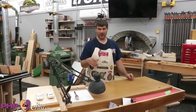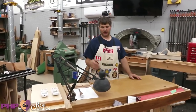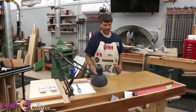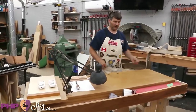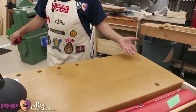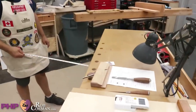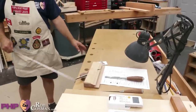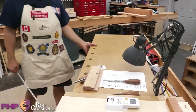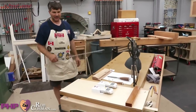So if you take that sheet, now they always give you an extra inch in both directions. So a 4x8 sheet is going to end up being 97 inches long by 49 inches wide. And you rip two 20-inch strips. We have a video that walks you all the way through this. But you take on those 97-inch strips, you cut off a 60-inch piece. So you have two premium 60-inch pieces, and you've got two pieces left over. So the full-size piece on top, a full-size piece on bottom, and the two pieces that make up the middle section are joined in the middle. Glue the whole thing together, and it's as if it's all now one piece. So you've got 3 inches of MDF.